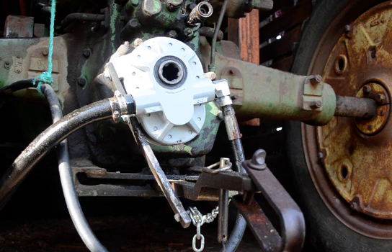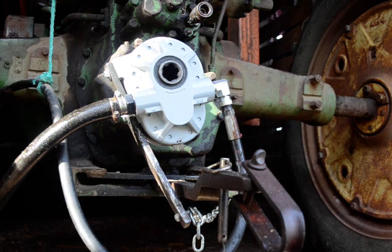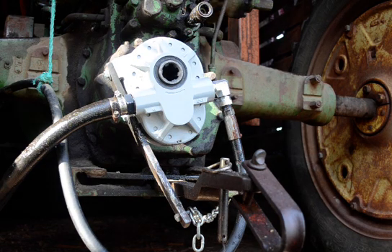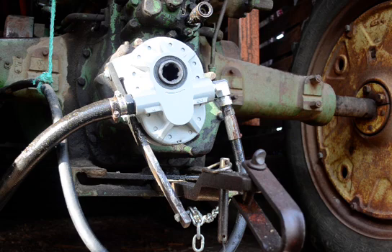There's no model number that can be found, so I couldn't cross reference to how many gallons per minute. My first question was just how big of a pump do you need. I found some references online saying maybe 20, 22 gallons per minute. What I discovered was that all the pumps have the same amount of lifting capacity — it's just the speed with which they lift. So I ended up picking a 17.5 gallon per minute pump.